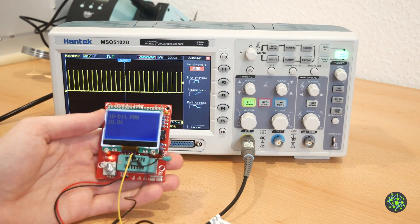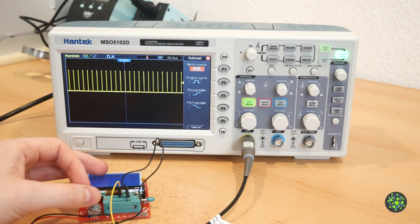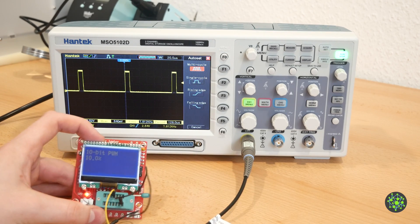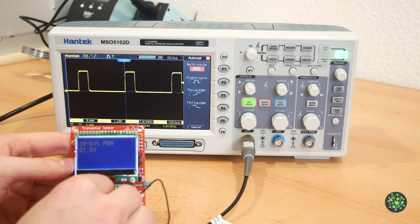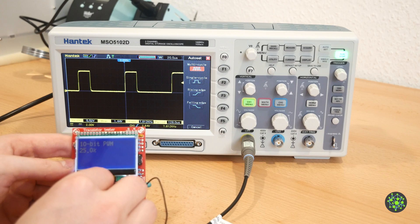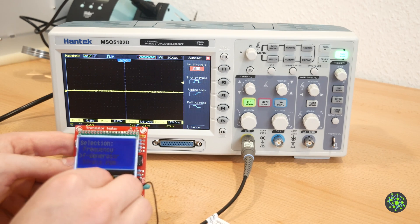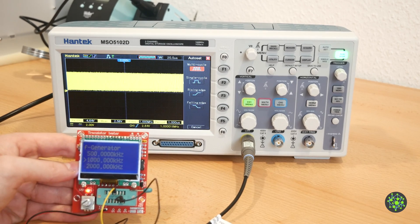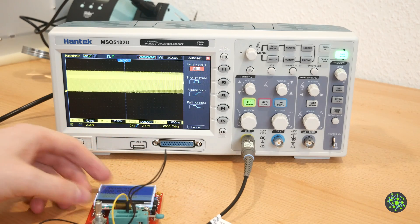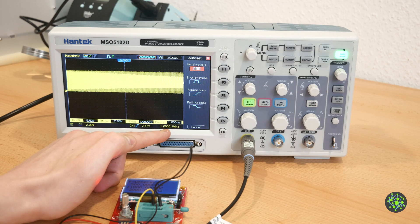So let's go with the PWM generator first. For convenience I will just hit the auto set. And there is our PWM signal with a pulse width of 10%. Let's increase it a little bit. As I increase it you can see the change on the scope. Now we will try the frequency generator and currently it is generating a signal of 1000 kHz, like the test signal of the scope. In the right corner of the display you can see the frequency the scope measured and that is 1 MHz.